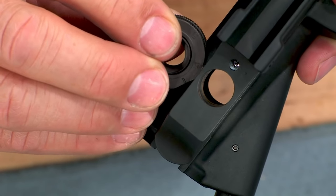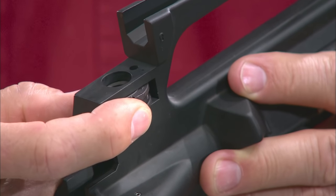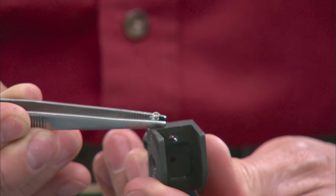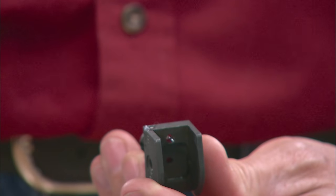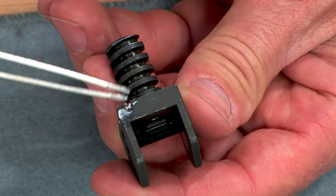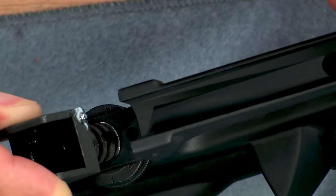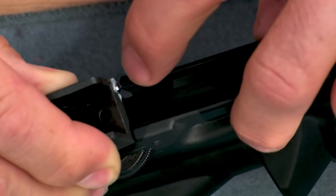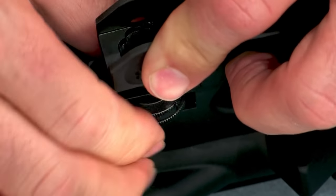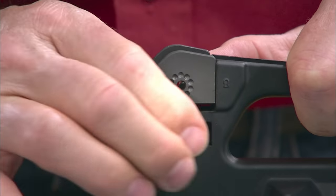The grease will hold the ball in place. Slide the elevation knob assembly into the elevation knob slot in the receiver. The detent ball should seat in any of the holes on the bottom of the elevation knob holding it in place. Now put a bit of grease in the rear sight base tensioner hole. Then slide the tensioner spring into the hole and put a bit more grease on top of the spring. Put the detent ball on top of the spring. Insert the sight base into the sight base hole in the receiver and screw the sight base onto the elevation knob. Don't dislodge the detent ball as you do this. Screw the rear sight base all the way in.